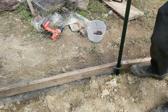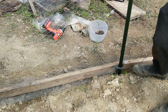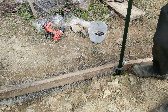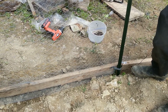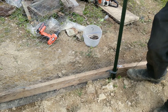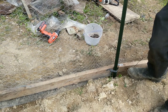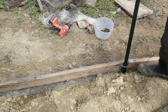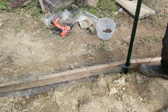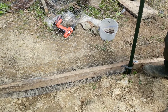The board we put on there is extra security — not just to keep the hardware cloth in place, but it's a great time saver. If the board wasn't there, we would have to wire about every inch and a half between the chicken wire sides and the hardware cloth bottom, which can cause the hardware cloth to pull up, which you don't want. And it's tedious, back-breaking work. This run is about 12 by 22, and that would be over two hours worth of work for two people. So with the board, Adam can staple the chicken wire into the frame boards, which makes it much quicker and at least as durable, if not more so.